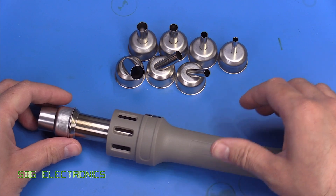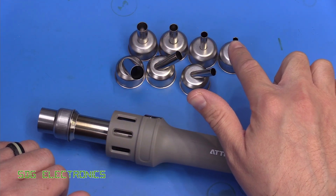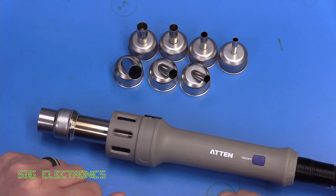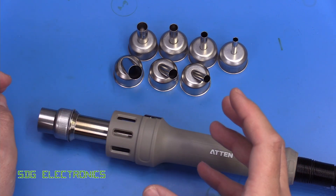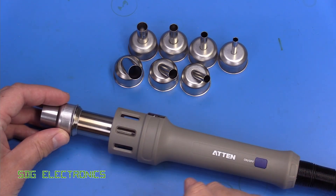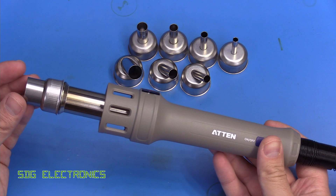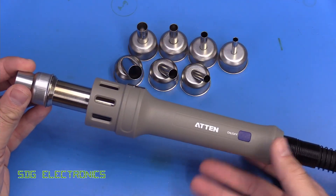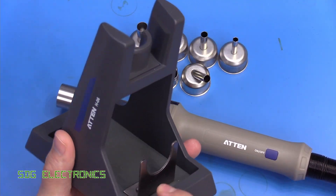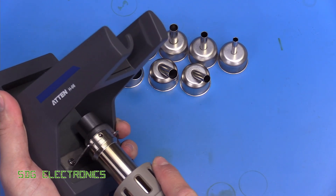This is the version that came with the 45-degree nozzles, and there's quite a selection — I think it goes from 10 down to 4 millimetres, and similar for the 45-degree nozzles. This should be more than enough for most needs. If you're doing specific work on the same IC repeatedly, you might want a compatible TQFP-type nozzle set with four nozzles aimed at heating the legs and not the chip. But for most general purpose hobbyist work, this kit will do you absolutely fine.